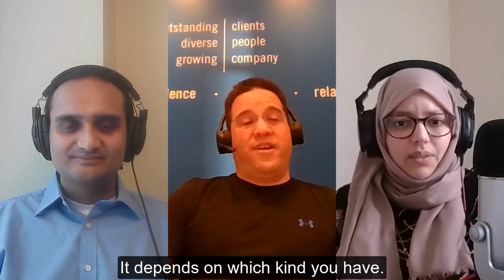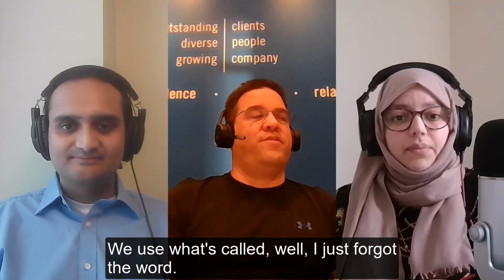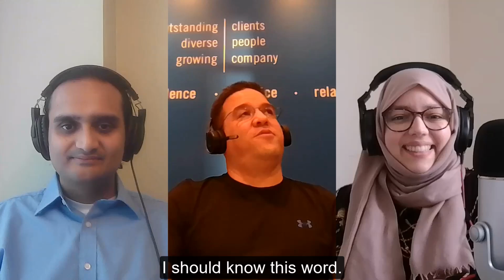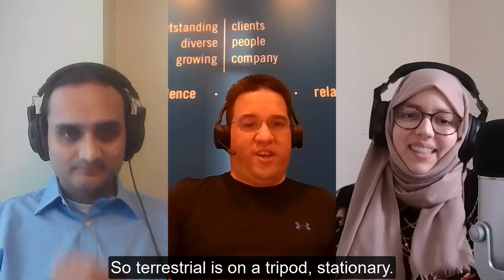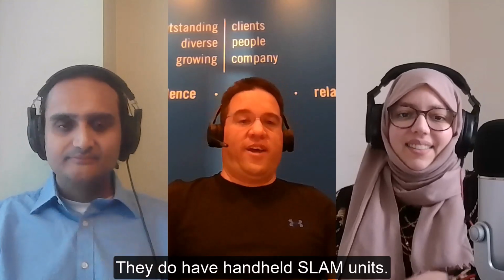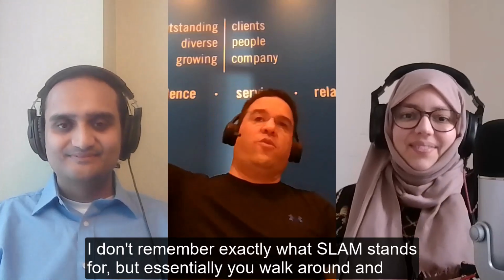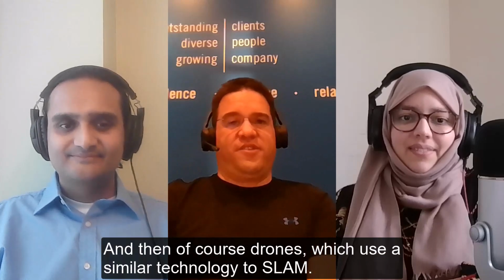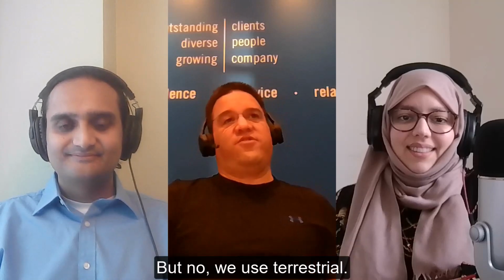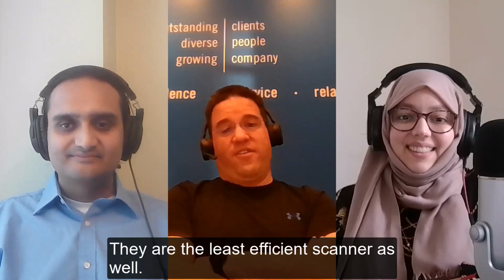It depends on which kind you have. We use what's called, wow, I just forgot the word. I should know this word. Terrestrial scanner. So terrestrial is on a tripod, stationary. They do have handheld SLAM units. I don't remember exactly what SLAM stands for, but essentially you walk around and it scans while you're moving. And then of course drones, which use a similar technology to SLAM. I believe it might actually be the same exact technology. But no, we use terrestrial. They're the most accurate scanner. They are the least efficient scanner as well.